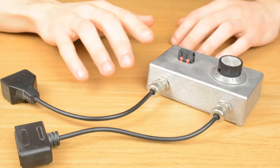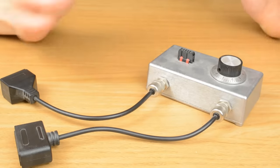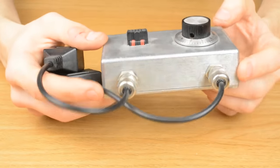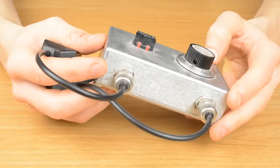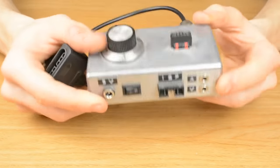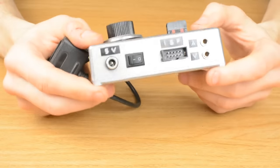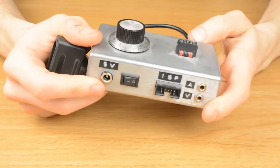In 2014, I built a games console. I designed and built the hardware, I wrote the BIOS, and I wrote all of the games for it. And obviously, it was all programmed in assembly. Instead of a composite video output, it has a vector display. So yes, it's the old trick of drawing pictures on an oscilloscope in XY mode. Although I used reasonable quality DACs for the output, they're only 8-bit, and the op-amps are meant for audio, so the slew rate is really bad, and kind of defeats the point of having a vector output at all.